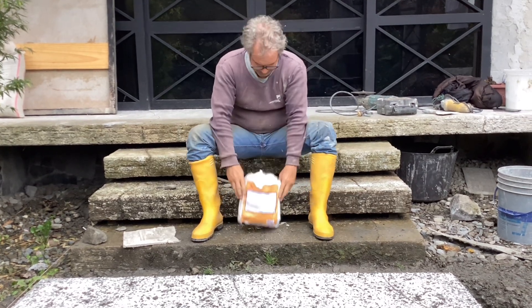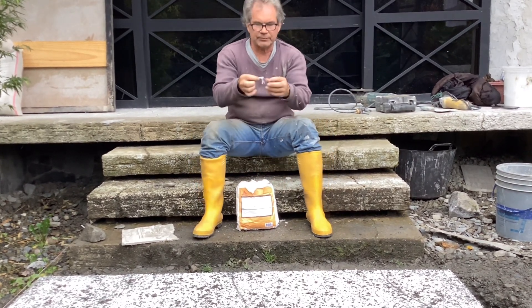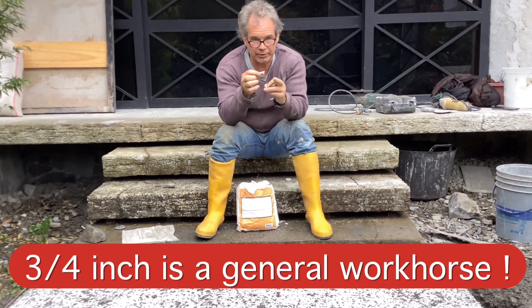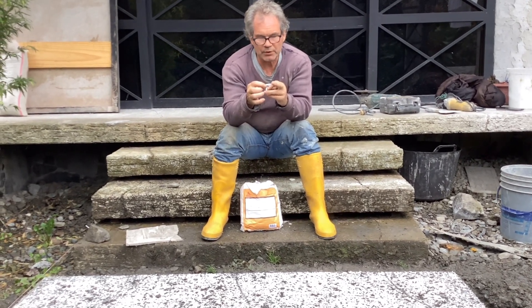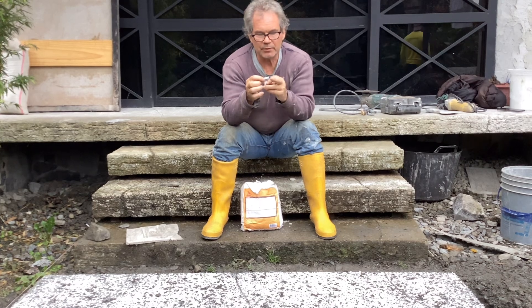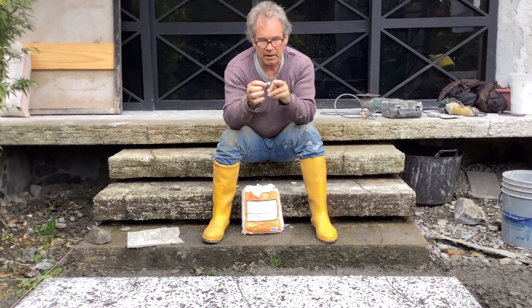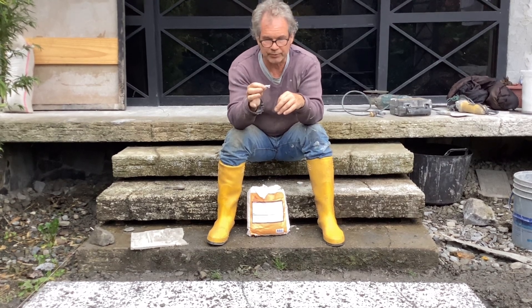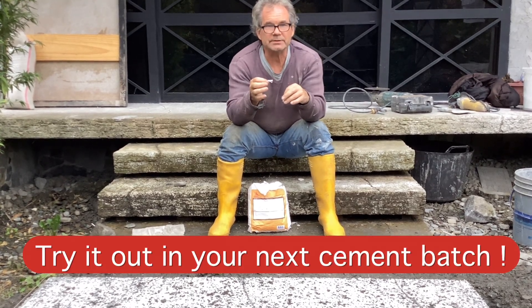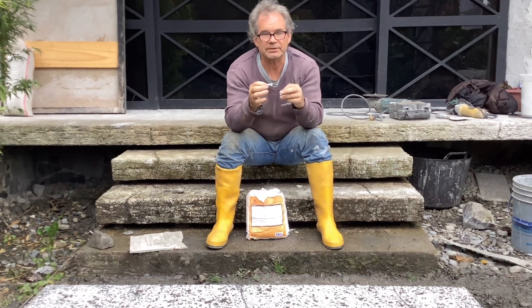Adding this material will make a big difference. One last important thing is the fiber length. This here is 3/4 inch, probably 1.75 centimeters. Tiny fibers have a different purpose, but this 3/4 inch fiber is really good for general cement work — copings, stairs, steps, artwork, concrete tables, whatever it may be. This really is a workhorse for almost everything. So next time you see a bag of polypropylene fiber, grab it, put it in your mix, and see how you like it. It is a great product.